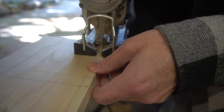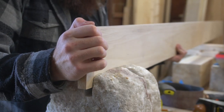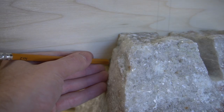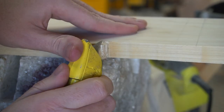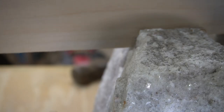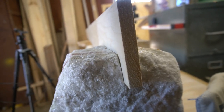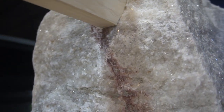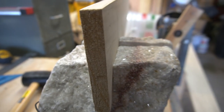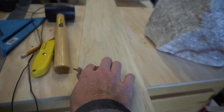I ended up having to notch out the bottom of the rails here because I could only go so deep with my circular saw, but it ended up working okay — I just had to do a little bit more work scribing. I was so excited with how clean this looked and how tight I got that joint — I was actually kind of surprised. For the second rail, I decided to fit these in separately before I cut out the notch to fit one over the other. Taking it out of the stone I've got a few scrapes, so I'll circle it with my pencil, sand off the pencil marks, and then it should fit a little bit better.